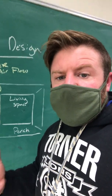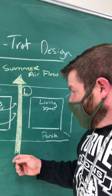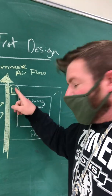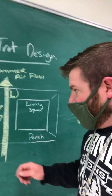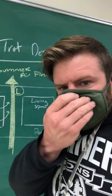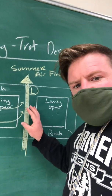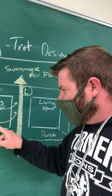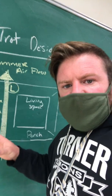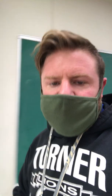This is all about keeping a house cooler in the American South. We've got this summer wind blowing through the building — here in Texas it's coming from the south going to the north, that's the reason I drew it this way. So we've got a huge low pressure area inside the middle of the house. If you open the windows on the two main living spaces — and there are two main living spaces with a wraparound porch — because there's a huge low pressure area here, it creates a vacuum and sucks air through the living space into the hallway and then out. Because the main hallway is so large and the windows are small, the pressure never equalizes and the breeze never stops. Every single time the wind blows, a low pressure area is created and draws air through the home just like a breeze — it's like being indoors but with a constant summer breeze.